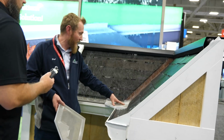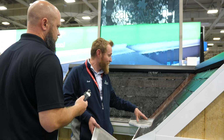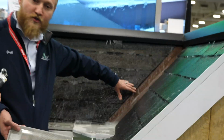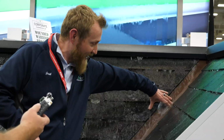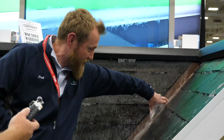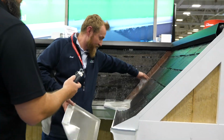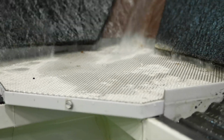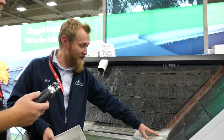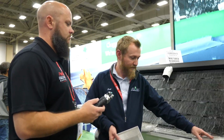This is our most popular miter. What we're demoing today is actually our directional high flow screen, and that's for the situations, usually in areas up north in the US, where you get an extremely high volume of water. I'm trying not to splash everywhere, but you can see that that's somewhere around 90 to 100. And the 24 mesh, unfortunately, would fill this tray because this was made to be rated for 60 gallons of water per minute. So we had to compromise a little protection on these, but drastically increase the amount of water volume that it will intake.